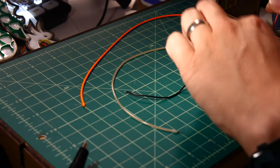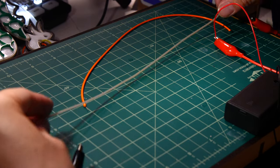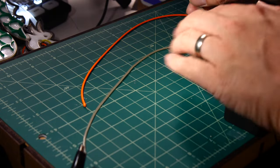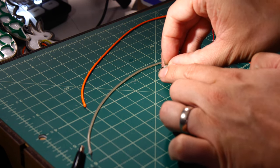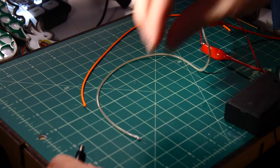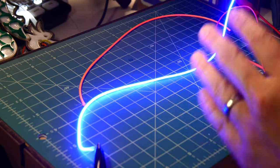That means you can use something like a 2AA battery pack — 1.5 volts times 2 — to light up a single strand. I'll demonstrate that with some alligator clips. Because this wire is so thin, there's not a lot of indication as to which side is positive and which is ground — you actually have to look at the very fine tip of the exposed metal. On one side there's a little hole punch; that's the positive side. Connect that to the positive lead and then the ground — and there you go. That's an incredibly bright blue light.